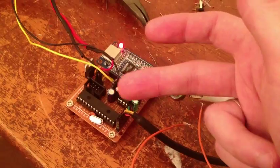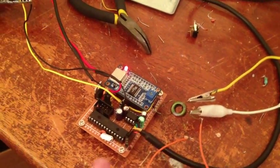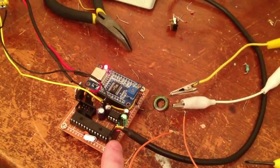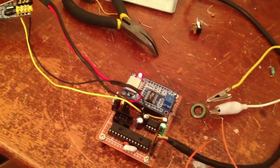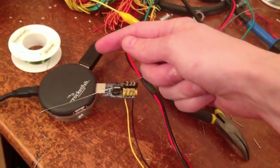The digital synthesizer board is controlled by an ATmega8. And this is the neat thing: it's interacting with the computer through a serial connection. These pins go to one of those RS232 adapter cables, and it gives me USB, so I can control frequency by USB.